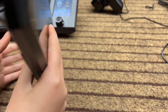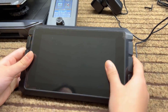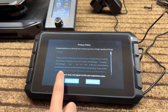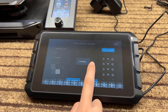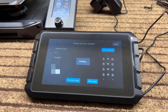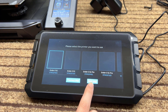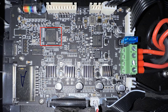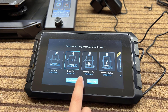To get started with the Sonic Pad, we only have to connect one power cable, and we don't have to connect the printer or camera yet. Turn it on, select the language, agree with whatever it says, select your timezone, connect it to your WiFi network, or plug in your Ethernet cable if you are using a wired network. Now we have to select the model of the printer. I am using an Ender 3 S1 with an STM32F103 32-bit processor, so I will select the F103 version.